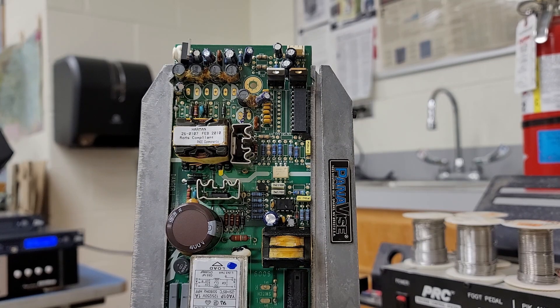About a week ago — today's March 8th, 2023 — I went over to help with the subwoofer, because it didn't want to work in the main auditorium with the new board. We figured out it was a routing issue. Digital boards work a little differently — you have to tell the board whether it's a scene or a layer, and route where you want to send the signal, whether to the subs, left channel, or right channel.